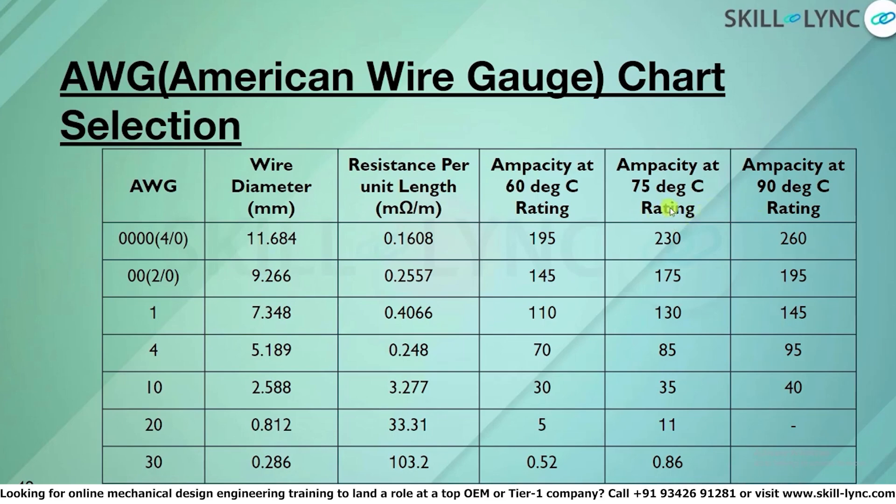If you are continuously delivering 2C or 3C current, the copper wire will operate at high temperature. If you are at 75°C but your insulation is only rated for 60°C, it will not deliver 230 A — it will be limited to 195 A and may slowly melt or even catch fire. You must choose the right insulation material, determine the temperature rise in the wire under operating current, and select the right wire length to avoid voltage drop and ensure reliable performance across the battery pack's life.